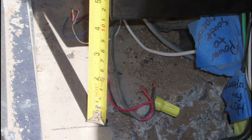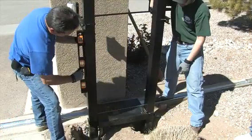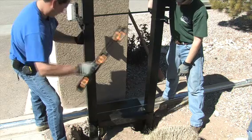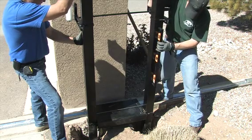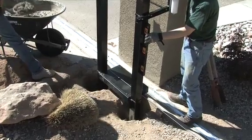Adjust the height of the slider guide mounting platform to 3 1/2 to 4 inches above grade. You might want to slip a 4x4 under it. Add the second U-bolt and tighten. Pour concrete around the slider guide posts, taking care to keep them plumb in all directions and level across the gate operator mounting platform. Double check your measurements from the string and gap opening.